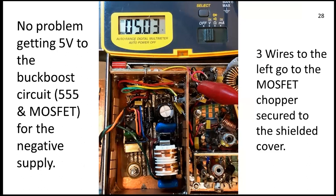The toroid above-right of the red alligator clip is a hand-wound common-mode choke for both in and out of the converter, so whatever you do to that thing, you don't want to mess up the PC or the converter. The small bent coil below the clip is a 33.3333 megahertz trap. I ran the oscillator on the fundamental — I had this archaic notion that it might be more stable to start with the fundamental and multiply it, but it seems to work.